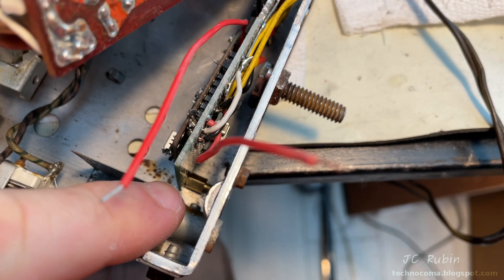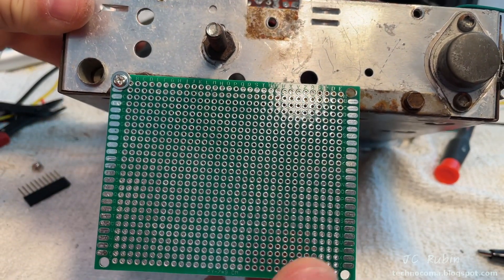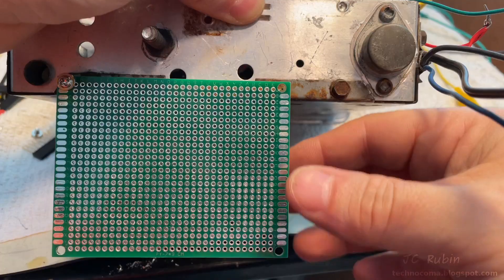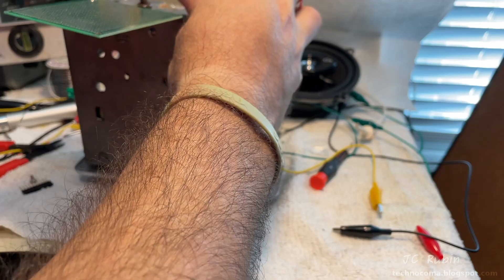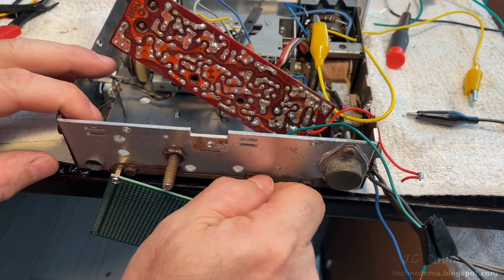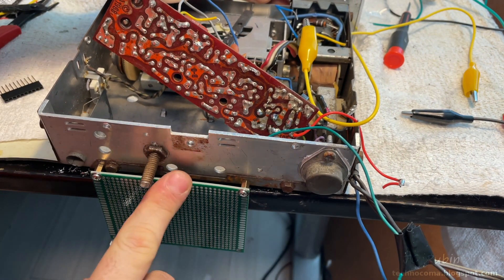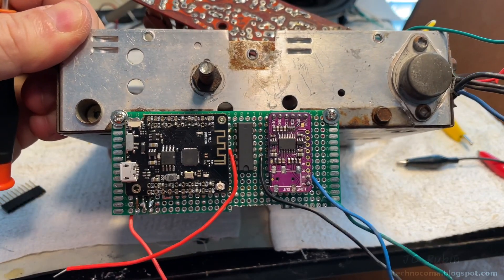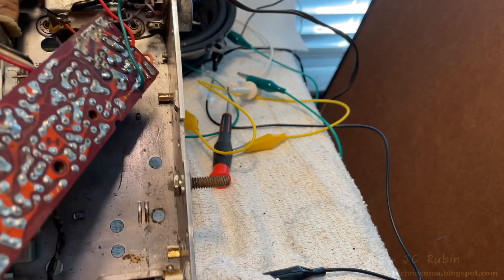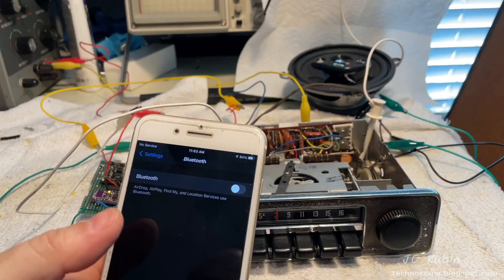I screwed it in just a little on the inside to check the height — height looks good, so I'll take it out. Using a similar board I screwed in one from the outside and set up the center of the second hole using that board. I now have what I believe to be a centered hole, so I punch it, drill it, tap it, screw it in, and test it. I was just a hair off — a little too far out — so I had to oval out both holes ever so slightly on my actual board. There's no stress and it fits just fine. Very nice. Both standoffs are now installed in the case.